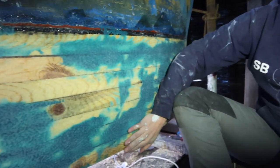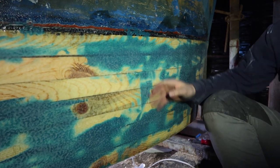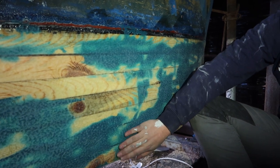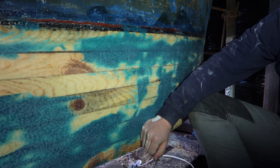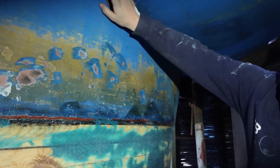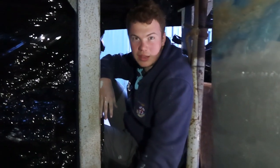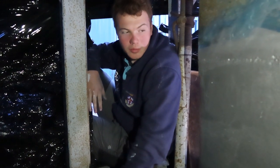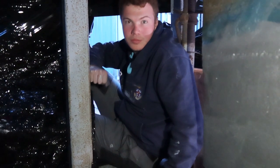So we've finished all the epoxy — there are now three layers of epoxy on the keel. We've just sanded it down with a really light grit just by hand. After this, we're just getting ready to paint it with some underwater primer. We'll probably put three layers of that on. I'm sandpapering the little spots on the keel where it's got back to bare fibreglass — just while we have the underwater primer out, we might as well patch those bits up as well. We've just painted the third coat of this underwater primer on. You can see it's a sort of shiny metallic colour, but it's going off so quickly — this is already quite dry. We're just off to let it dry properly and then we'll be back soon to put some hard racing antifoul on. That's it.